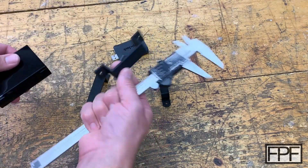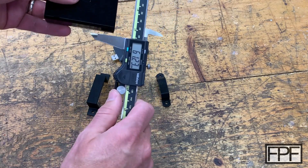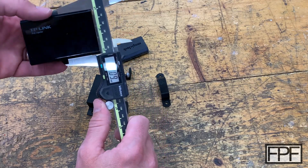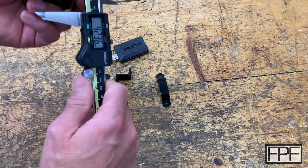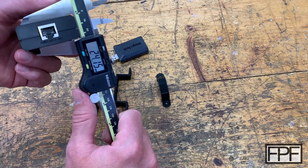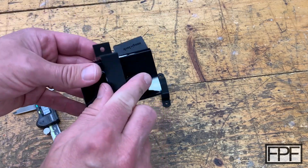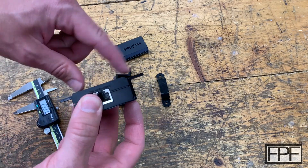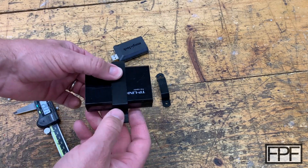If I was making a mounting bracket for this one, there are really two measurements I need. There's the measurement in this direction — this is 54.09, so I would probably design this at 55 to give it a little bit of space. And then the depth of the item — this one is 24.17, so I would go right at 24. That way we're a little bit snug, so as I put this on here these guys sit just shy of the bottom, and when I tighten it down with screws it pulls it against the wall so that it doesn't move.